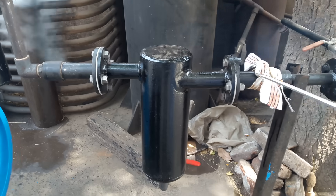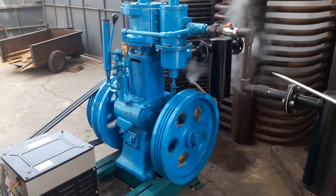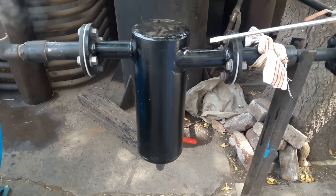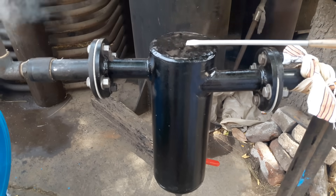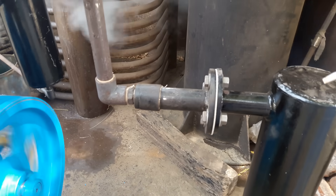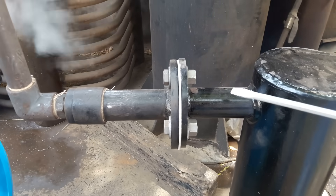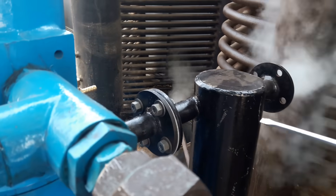While the steam is coming, it is being condensed here, so that condensed steam will obstruct and will not run the steam engine properly. So we have to separate the condensed water — here is the water separator. The entry of steam into this vessel, this water separator, is tangential and the outlet is from the centre. So while fitting this one, it should be ensured that entry is tangential and outlet is from the centre. This is the oil separator — there is also a tangential entry and outlet is from the centre.